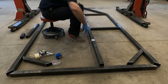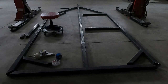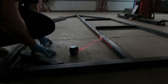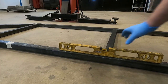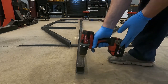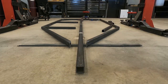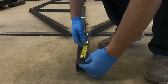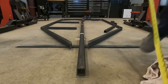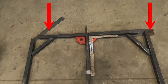Now the pieces are ready to be tacked together. But before I do that, I have to make sure everything is perfectly level, and I did this a couple of different ways. The first way is I put some masking tape around the center spine, drew some lines right down the middle, and then used a laser level to make sure it was perfectly straight. In simpler ways, I just used a regular level and checked the bubble on it from time to time. To make sure the trailer will be perfectly square, I drilled a small hole at the center of the neck of the trailer, inserted a drywall nail into this hole, and used the head of the nail on my tape measure to go back and forth from left to right. I also used some metal shims in the front, one on the passenger side rear, and one on the driver's side rear to help make sure everything is level.